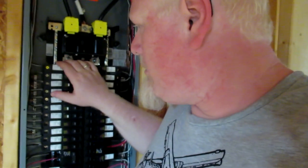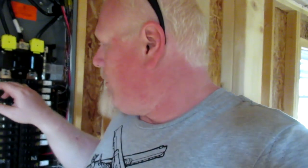Having this one breaker — the connection between all of them is 14-3. For any circuit that has a 14-3 wire in it, or 14-gauge wire for that matter, you need a 15 amp instead of a 20 amp. So I've got to replace two breakers. I've got a three-way switch that also has a 14-3 in that circuit, so I've got to change that breaker out also.